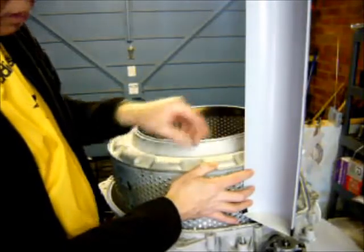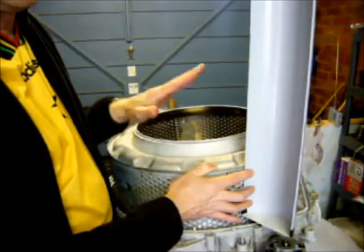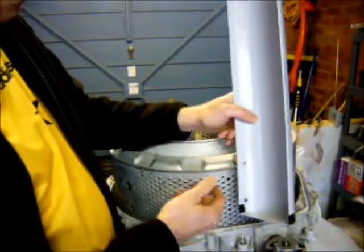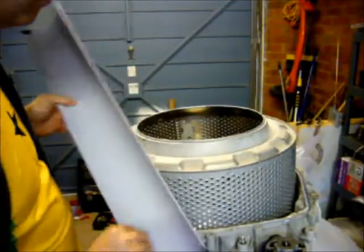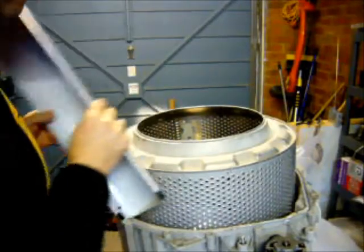The way it's bolted, it's going to turn the drum anti-clockwise, and that's what we want, so that this motor is going to produce a positive voltage. Because if it were turning clockwise, it would produce a negative voltage. So whatever way the wind blows, it's going to turn anti-clockwise — that's what we're after.